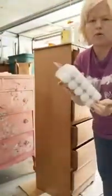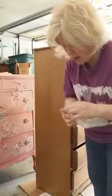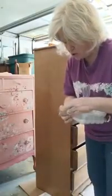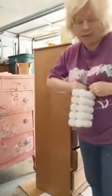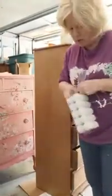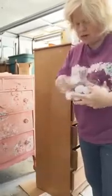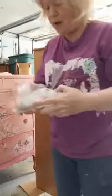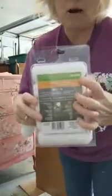So you want to then use a roller. The rollers that I use if I'm painting a large surface, a tabletop, let's say I'm doing a French provincial dresser top, I use these rollers. I buy these on Amazon. I go through a ton of them. I'll show you the front so you know. It's a foam roller. You don't have to buy this brand, but it's a foam roller. Foam. And these will give you a good finish. Shoreline, I get them on Amazon, okay?